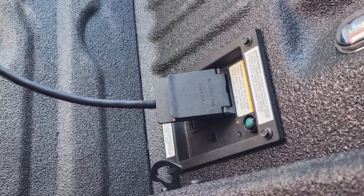This one is different because we're actually going to tie into the truck's onboard inverter — the 120 volt outlet that's near the tailgate — as opposed to doing a DC to DC charger, or chassis charger as it's sometimes referred to. Essentially, we're going to be able to use that truck as a generator. Let's check it out right now.